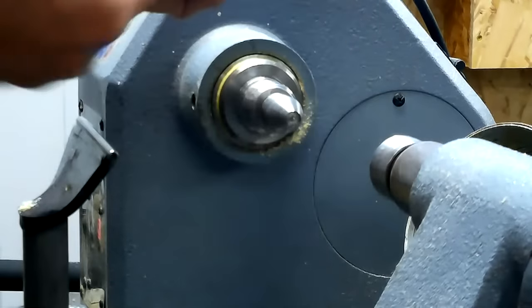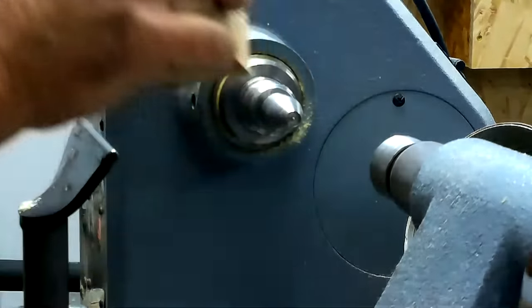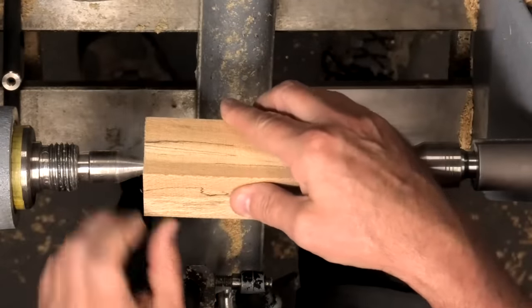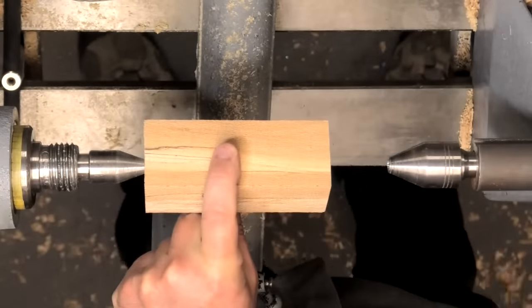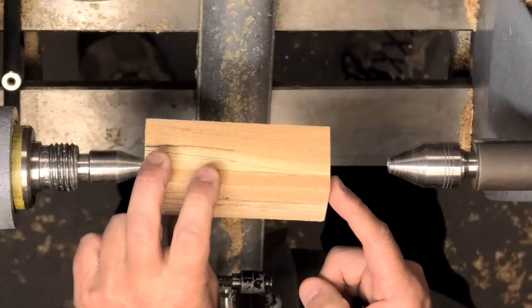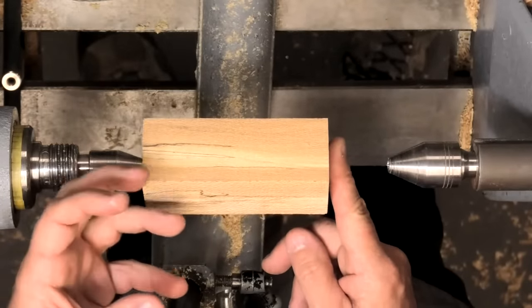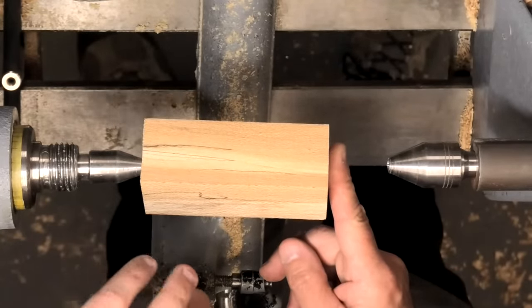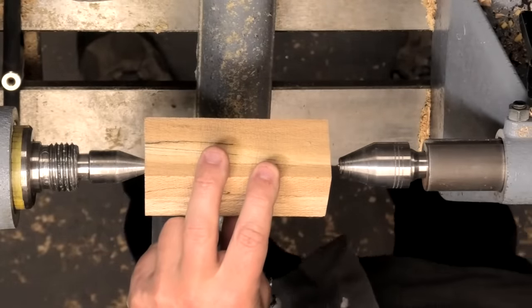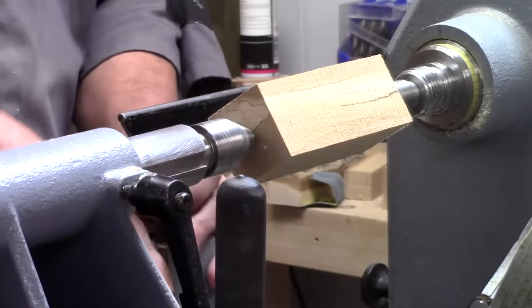So remember what I said about that, the markings in here. Let's go that softer area right up the top. So that's going to be thick area here, thin area here. The reason I've done that, if you think about it, if I had the thin area this side, all that torque is going through that section, and there is potential that it could sort of twist or break. So we're going to have it to the tailstock and keep the strong area where most of the drive force comes from. So there we are between those two centers.